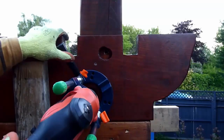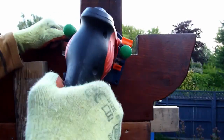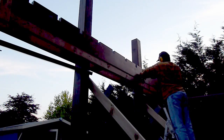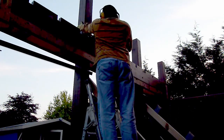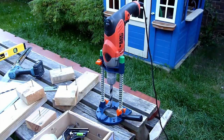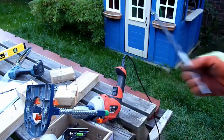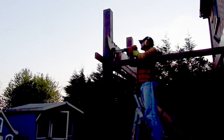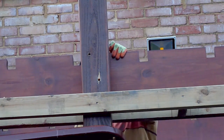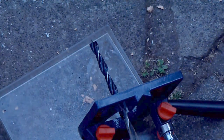The plan is to use M10 coach bolts, so I'm using a 12mm drill bit to mark the positions on the girder onto the post. I started with a 150mm long drill bit but then changed to a 300mm length one so the drill actually penetrates through the girder, post, and out the other side. The 300mm bits from Amazon were a bit cheap and started getting blunt and hot very quickly.